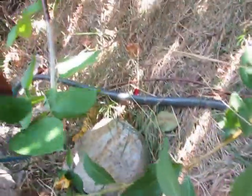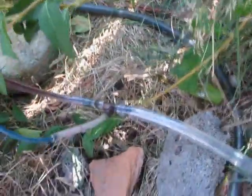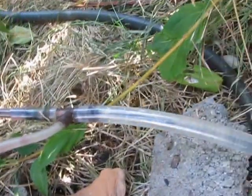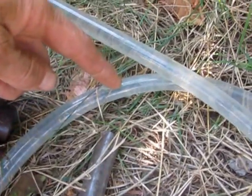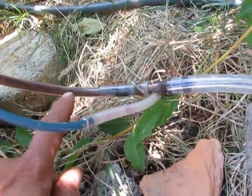The air for the pump comes from a little control valve — just set it and leave it. This is demonstrating what a constriction does to the process. As you can see, the water is speeding up and slowing down. Essentially what's happening is water goes in and gets stuck up here until there's enough air to push it up further again.